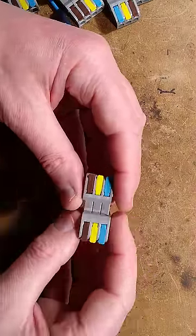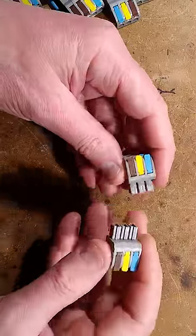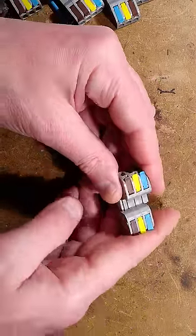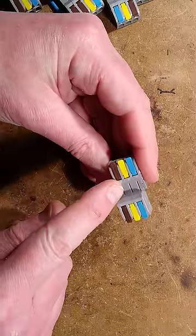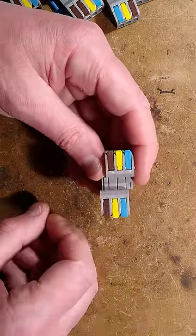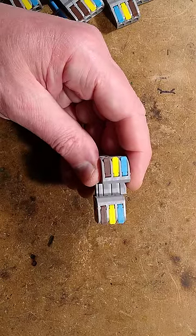But because it is universal, if you were fumbling around the back of a machine and you were plugging in a component that was getting live, neutral into Earth, and you misaligned the connections like this and plugged it in, live would connect to the Earth connection and the whole case of what you just plugged in could become live at mains voltage and result in horrible things.